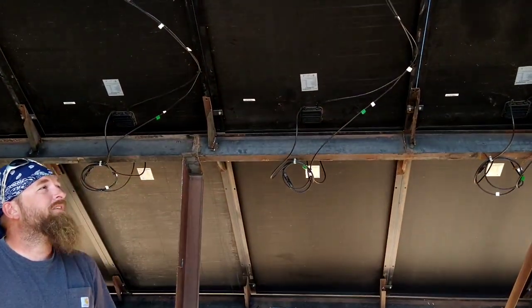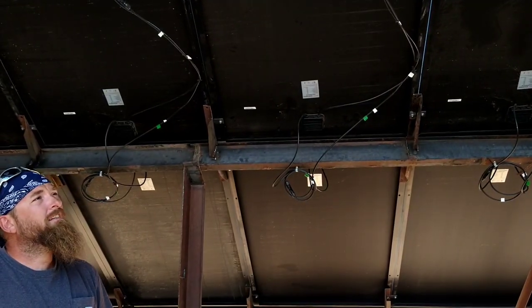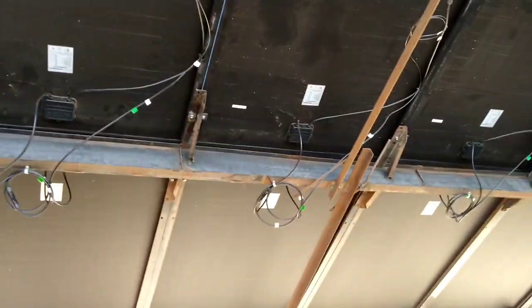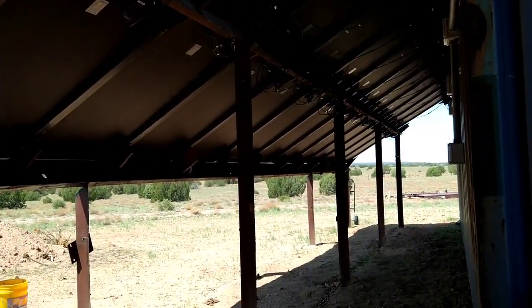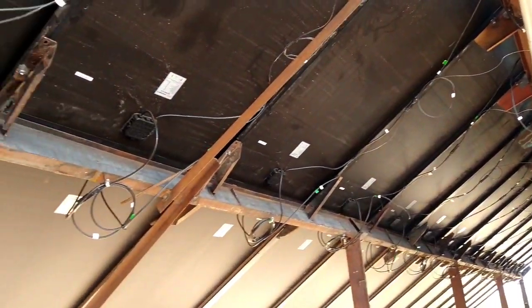This system is built from 78 OVA 255-watt panels. They're wired in series — series of three — and then 26 in parallel. And that gives us 19,800 watts, 219 amps.